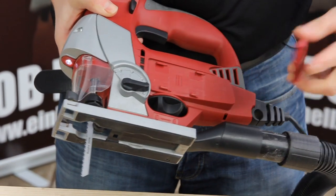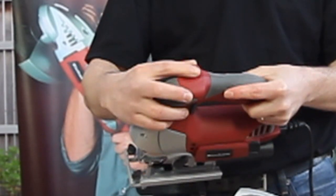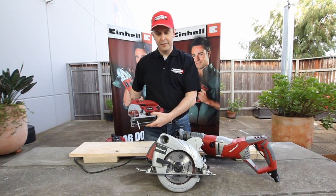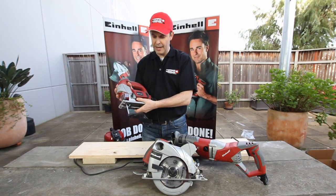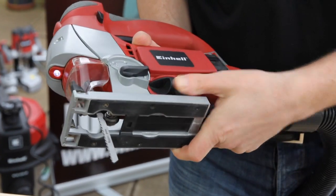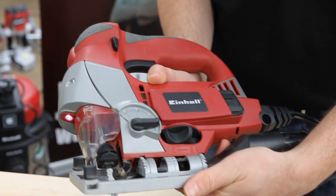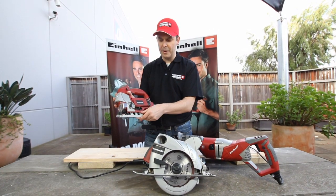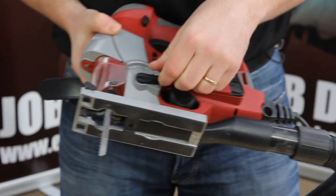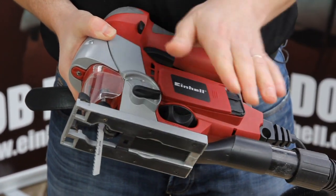Blade storage is on board with additional blades. Variable speed, dial in and dial out. One of the very innovative features is it allows you to easily change your baseplate angle just by dialing this dial, and you can automatically and very easily move the baseplate to whatever angle is needed, which is very easy to see on the baseplate itself. You also can control the stride of your pendulum into three different settings.